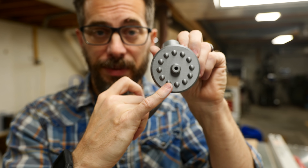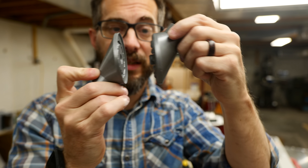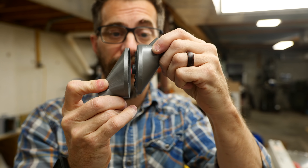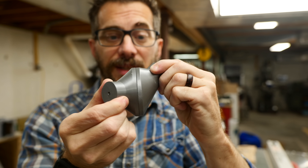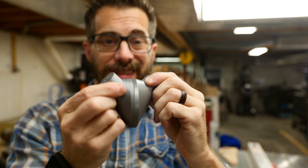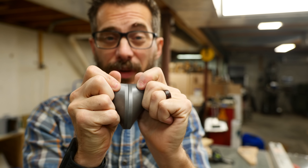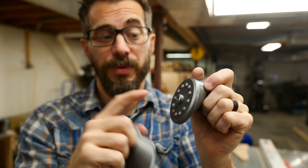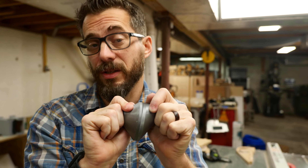On one side we've got some bumps, and on the other side we have some little divots that match up with those bumps. That lets us put the two pieces together — they go flat, but when we loosen the tension they can separate, rotate, and then lock into the next position. That allows us to rotate these pieces and get them to stick whenever we add some tension. Unfortunately right now because it's a raw print there's a lot of friction and it's actually really hard to turn them. So we're going to add some paste wax on the inside so that the two pieces will move freely when they're not under tension.